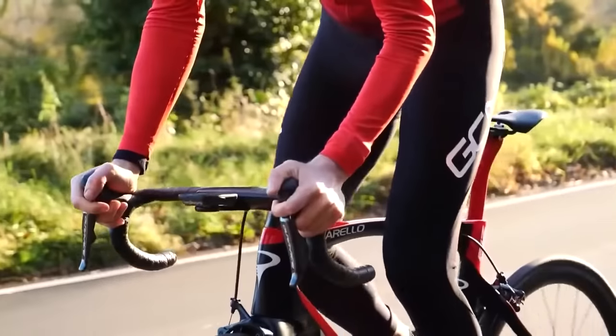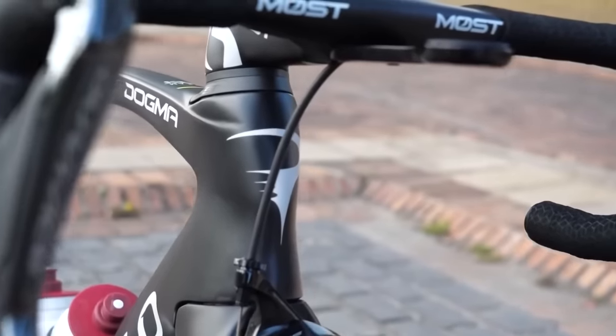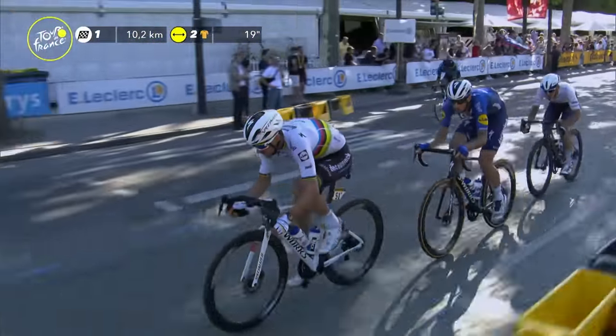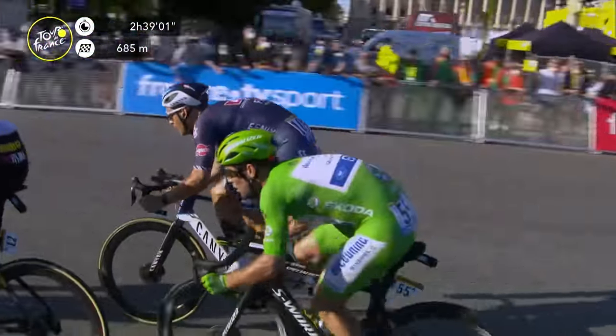Well, short answer is yes, they will. All materials fatigue over time. I think the thing which controls how quickly your fatigue will occur is the strain that you're applying. Fatigue is a cyclic process, and we can describe it either in terms of the cycling of the load, so the variation of load, which gives you the stress, or in terms of the cycling of the strain, which you can think of as the deflection. In composites, it's the cyclic deflection which is really important. The bigger the magnitude of that deflection, the more fatigue damage you're going to develop, and over time, you're going to cause degradation of the properties of your composite.